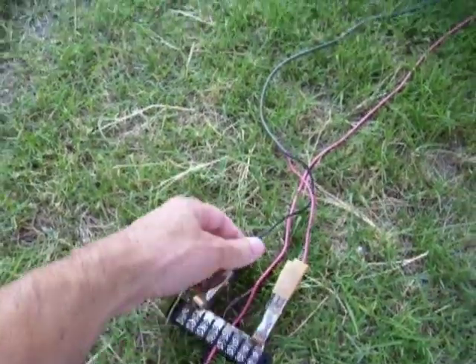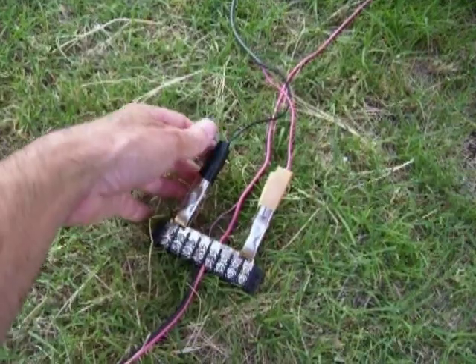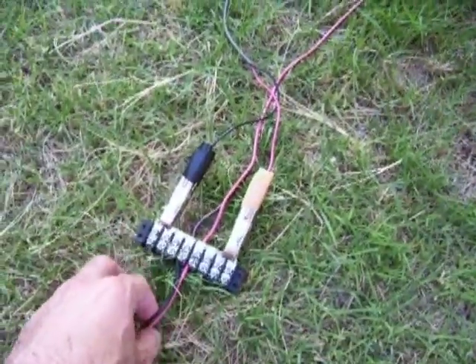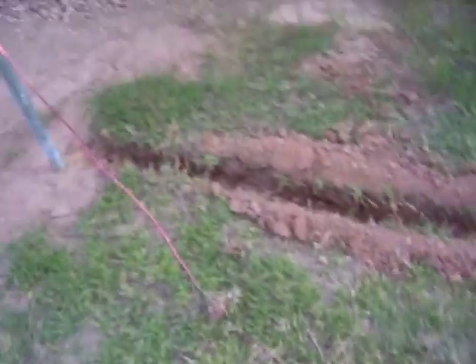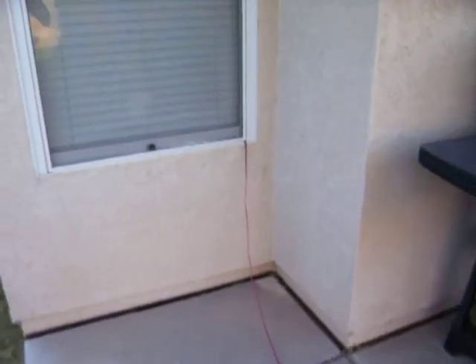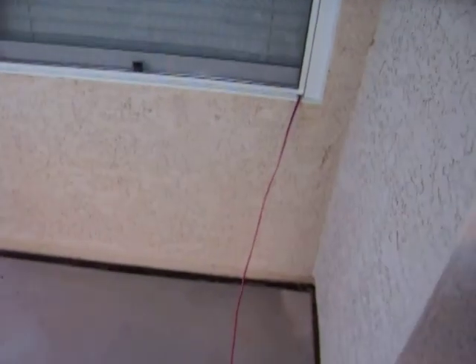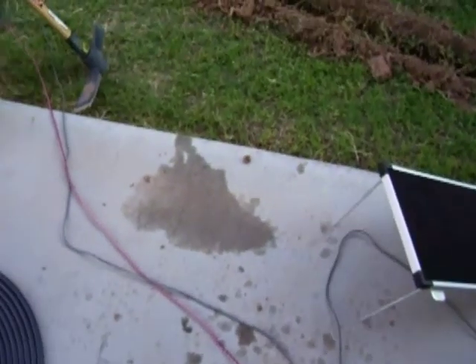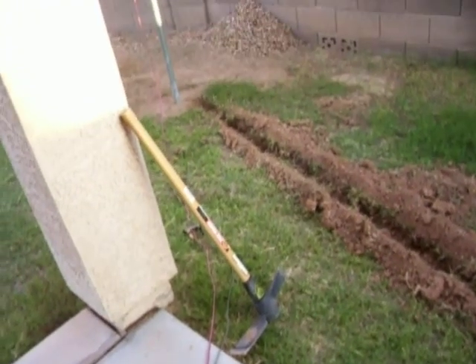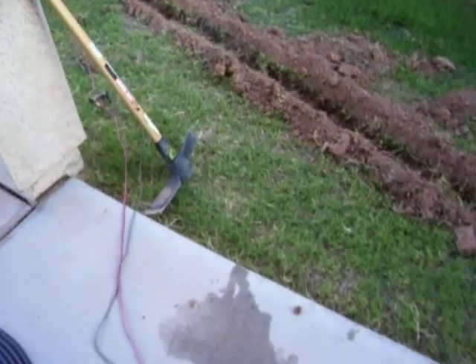The wire was too short, so I had to put a splice here, and I decided to hook up a little 5-watt panel over there to feed in a bit of extra power. That makes it 50 watts total with the little one back there. Power runs into the house right now through the window. It's kind of a ghetto setup, but I have it hooked up for testing. I've had it hooked up for about a week like this. It doesn't really rain much out here in Arizona, so I haven't had a problem.